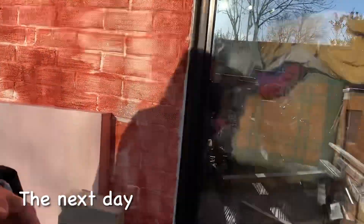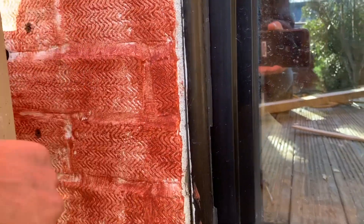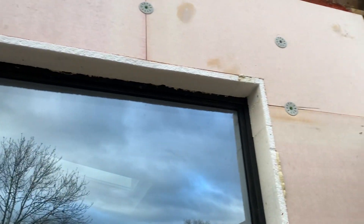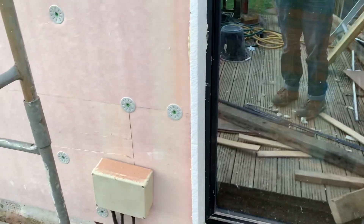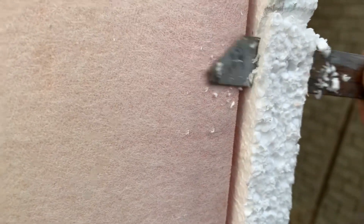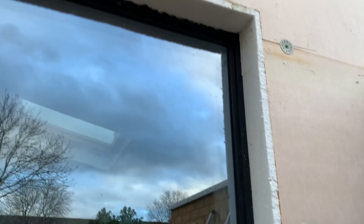I'm just going to put the boards in here, up this bit of wall. As before, I'm taking off this bit of trim so that I can get the boards completely flush with this bit of wall, and that will enable me to put the insulation on the side and have it marry up with both the wall and the insulation boards. All the insulation is around the sides now — it wasn't too difficult. You can see at the top it meets with all the corners and it's well sealed with the expanding foam. Now I need to cut off a little bit at the side here to make it flush with this insulation board. With a blade like this — even a kitchen knife would do — I'm going to go all the way around it and cut it off, making sure it's nice and flush. That's done now. The insulation's all in place around that window frame.